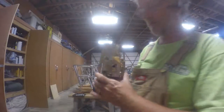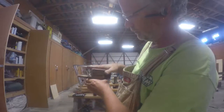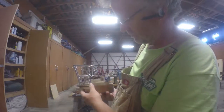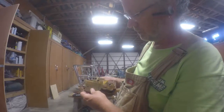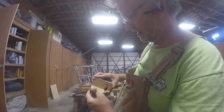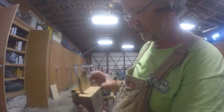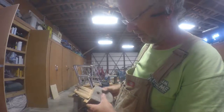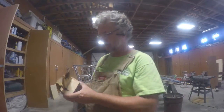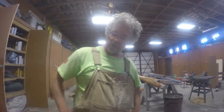This is the piece that used to sit on the deck. That's the spacer, the boomkin set like that. And for some reason, somebody had put like a 1/4-inch spacer, and that is not Douglas fir, and it did rot. And the rot transferred from that little piece into the wood, and you can see. Looks kind of ugly. So all in all, I'm glad I replaced the boomkin, but for 40 years' worth in a marine environment, that's pretty impressive.